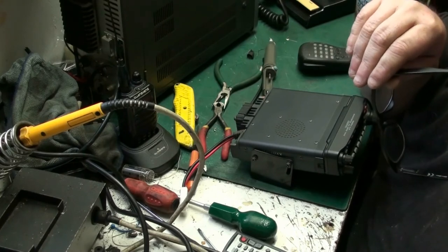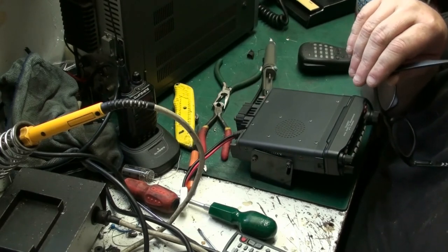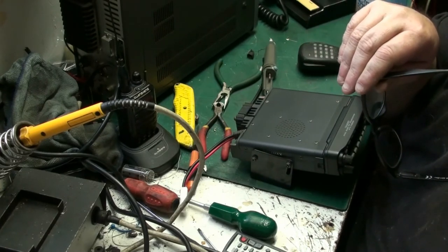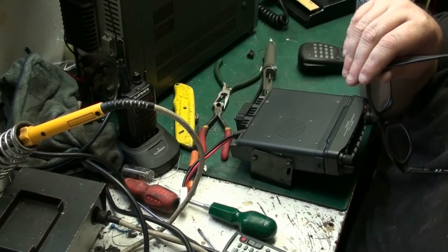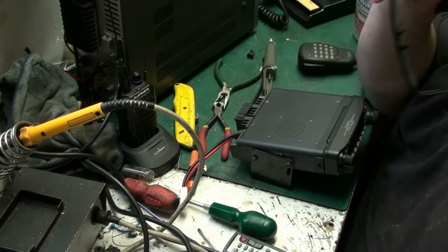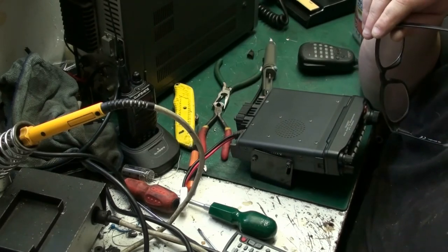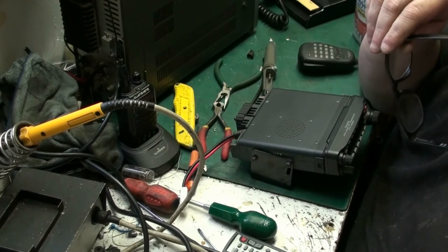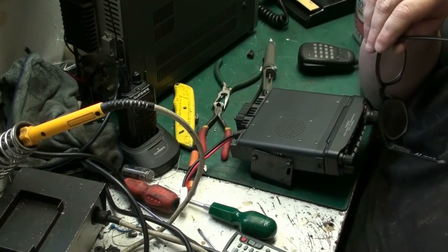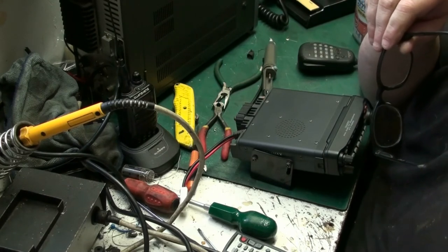I've got a Dynatron Berserker amp, actually. I need to pull that out and maybe do some tests on that. Put a tone into it. I shouldn't have to make up any dummy loads. I've got a watt meter there, which has got dummy loads built in, up to 10 watts, so it should be all right. I'm going to look at doing stuff like that, showing you the response curves